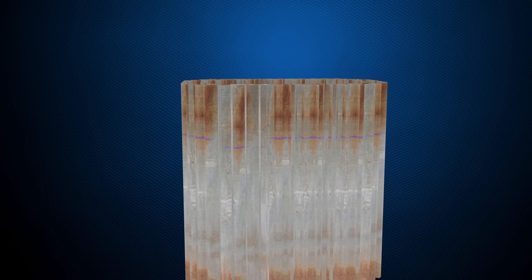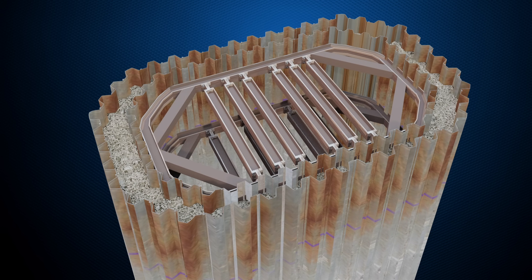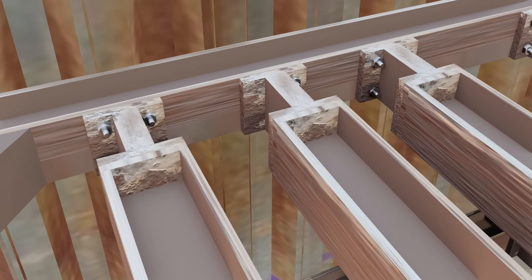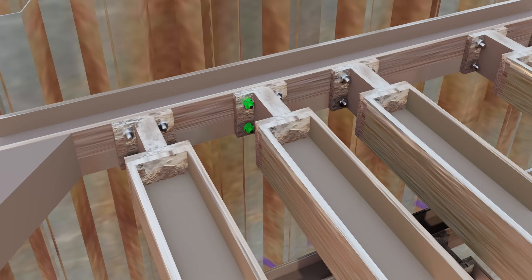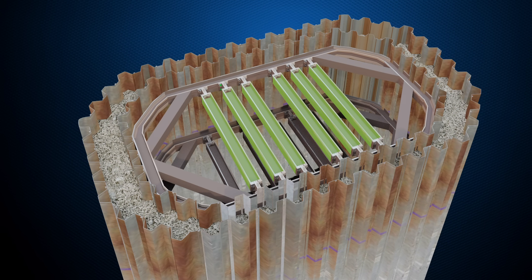The inward collapse of sheet piles can be prevented by erecting a bracing frame structure alongside the sheet piles. The bracing frame system comprises components like wales, struts, and braces, with the connection between wales and struts being bolted. These horizontal members called struts provide lateral support which resists inward movement of the cofferdam walls. The cofferdam is now super strong and has reached the bedrock.